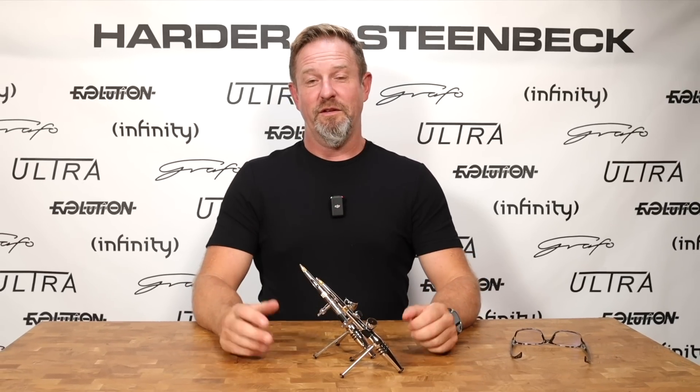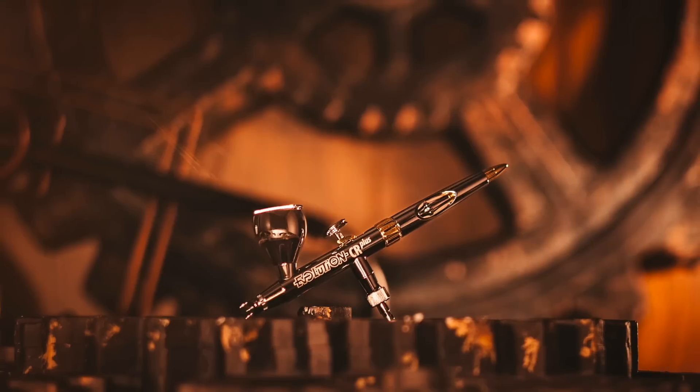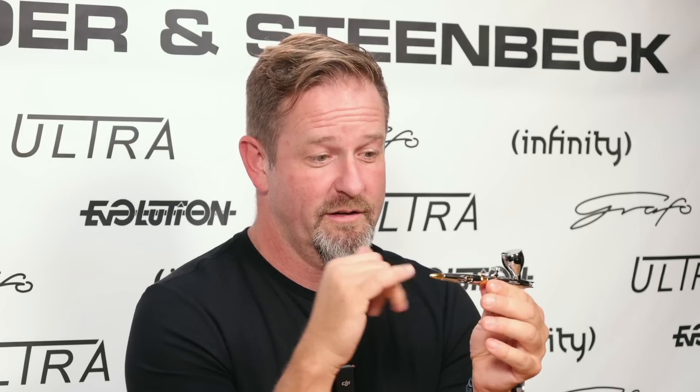We've also changed our needle packing material to a fully machined PTFE seal. The friction is almost indistinguishable, but the sealing is super reliable and we believe they're going to last for decades. The airbrush is completely finished in triple chrome plate — the ultimate finish for incredibly easy cleanup and years of robust performance. You'll notice also our traditional gold middle piece and gold X-Center. Gold is employed on these parts because it has a slightly better sliding coefficient than chrome, and this is where the needle guide parts slide — so using gold as the bearing surface gives a slightly smoother trigger response.